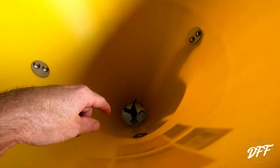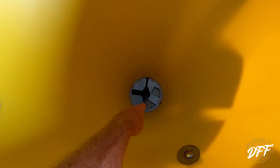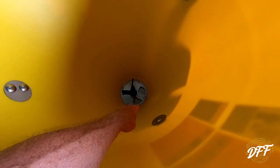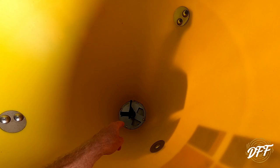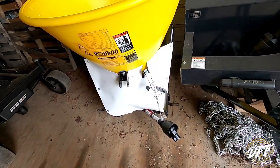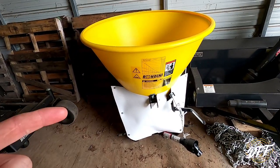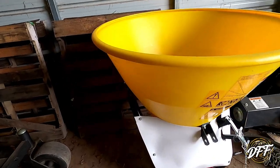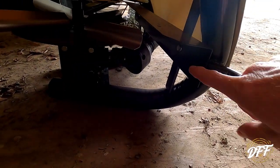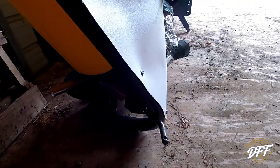This one also has a better auger design — instead of a tiny little thing going around, it has what I'd call a 'foot' that spins around down there. That's a much better design because on my old spreader, if you got a little chunk of fertilizer it would plug up one of the holes. This one is a lot better built, just way heavier duty. There's an L-shaped guard here, and the paddles are stainless steel too, but even with that guard it does not stop the fertilizer from flinging back at you.